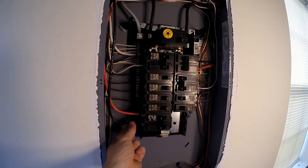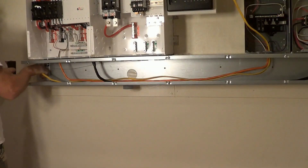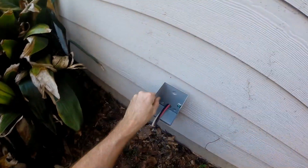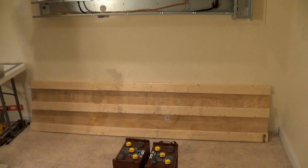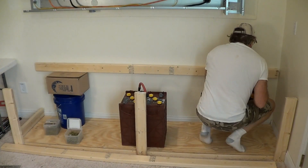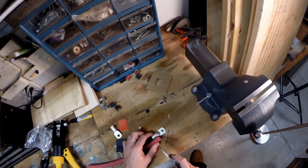Utility supply to the solar — you got the L1 and L2. It's putting out 200 to 243 volts. I put a plug on there — a generator plug. Got to do one more output circuit. So there's the base and I'm going to have to build this side up. I'm going to cut the insulation off of this cable.